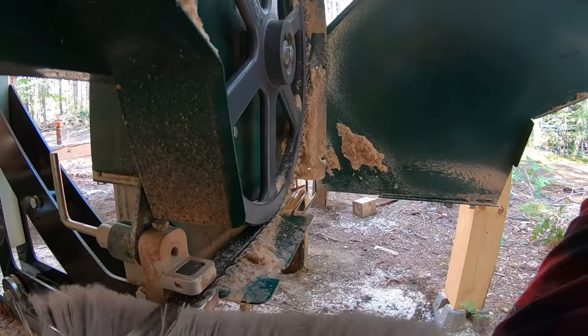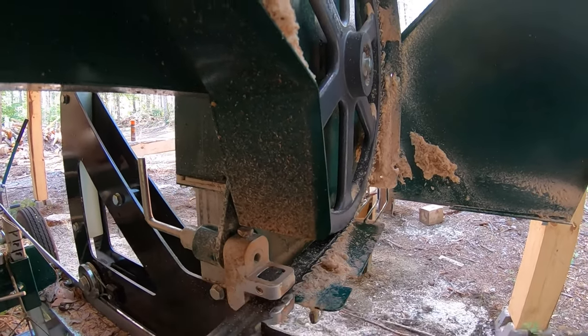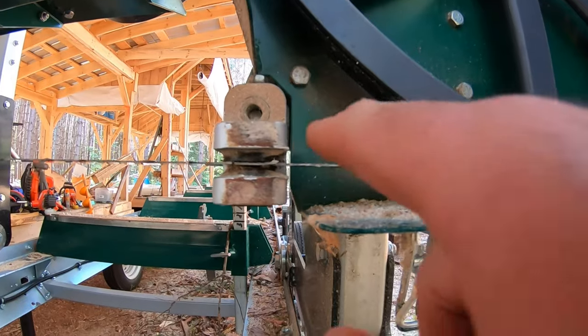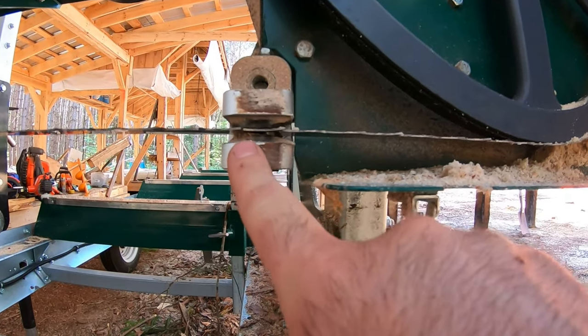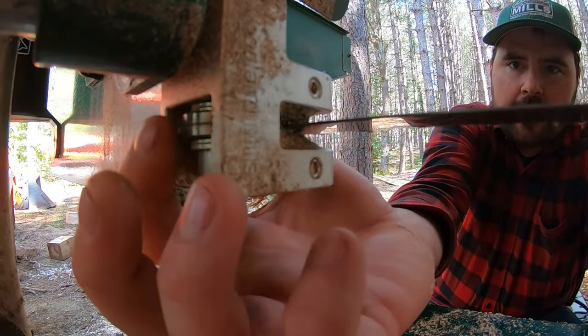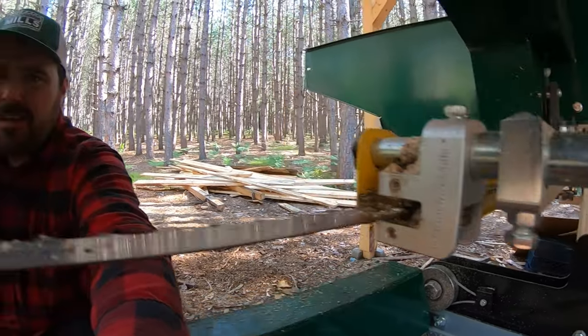If you saw quite a bit like I do, you're going to have dust in your sawmill. I use my blower quite a bit to clean things off. You might not be able to see it clearly, but there should be a gap there between that blade and the top guide block, and between the blade and the bottom block — that gap is 0.5 millimeters or half a millimeter. When we go to the back, the gap between the back of the blade and the guide bearing should be one millimeter. You're probably going to need a feeler gauge, or some thick card stock is going to be your best bet.